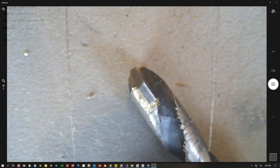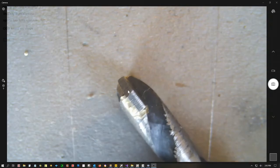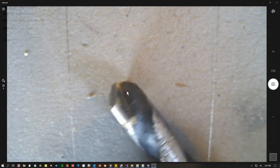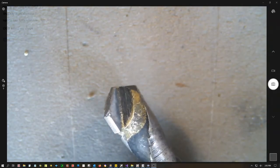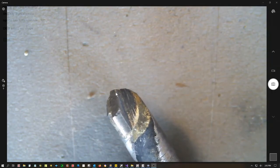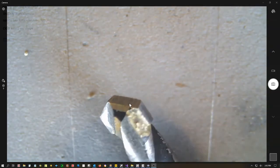Now we're going to take a look at another one that I have doctored up by hand on a carbide grinding wheel. You can see the cutting edge on the outside is now sharp. This edge is fully ground with a relief, relatively sharp edge. Rotate and take a look at the other side — this edge is sharp. I have been using this and it's got a little bit of a chip out of it, but that can be ground out again. We have the relief edge and the cutting edge here — it looks much better than the out-of-the-box drill.